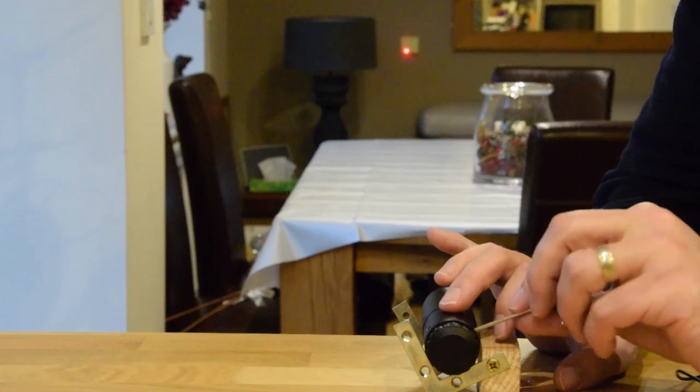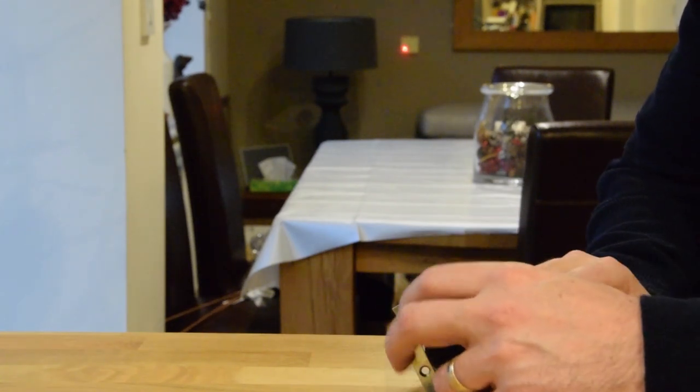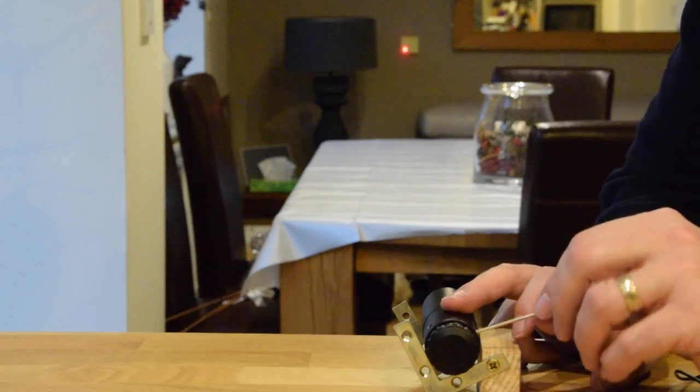Okay, so if I turn it around now, just about all the way, you can see it's moving upwards and back downwards again. Right, so I want to take about half the distance and adjust that with the Allen key. Okay, repeat the process. Tiny little bit more on the same screw. It's useful to use the numbers, which are usually there for the brightness levels, to remember which screw you're adjusting.